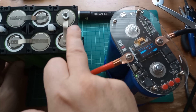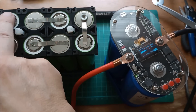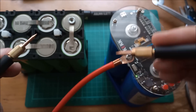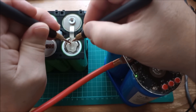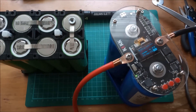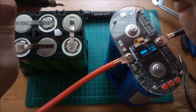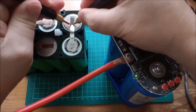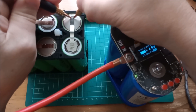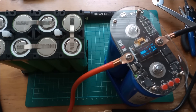The final strip is the one that goes across here, which mirrors the two end points — so this is my main negative. Let's get this one spot welded on the positive side first. Okay that's good — take the magnet off and slide it off, then do the negative end. Let's do four pairs, why not. I think that's all the spot welding. I'll just check the voltage across the main positive and negative.